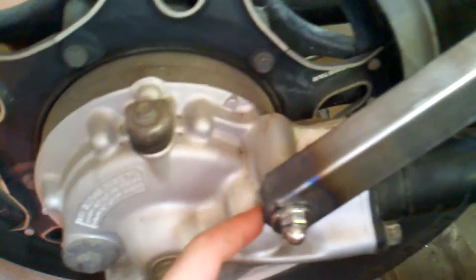I just didn't like the way the bushing was hanging out there at the transition from the tube to the bushing, so that's fully welded on both sides. All I need to do right now is fully weld everything. I think I'm going to fully weld it in place as much as I can, because I don't want to take it out of position — if I put it on the bench and weld it, it's going to move, distort, stretch, or shrink all over the place.